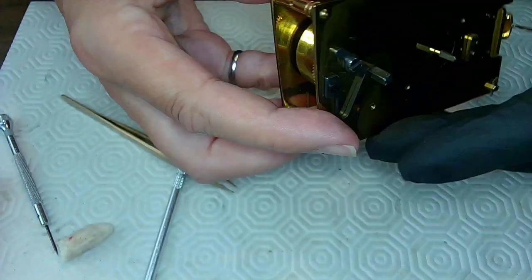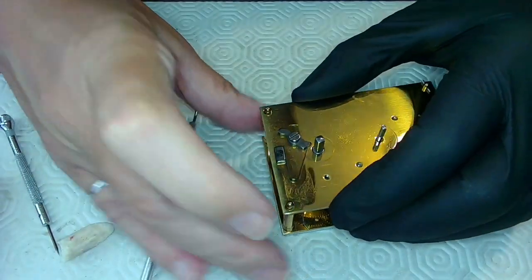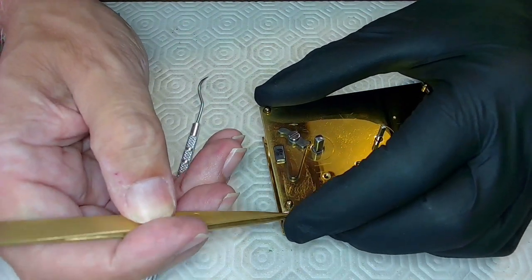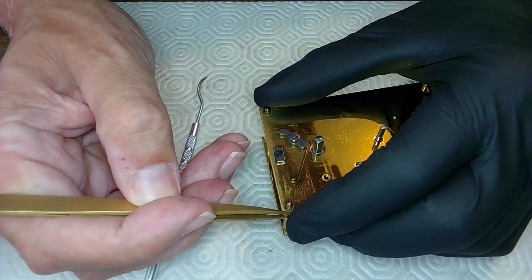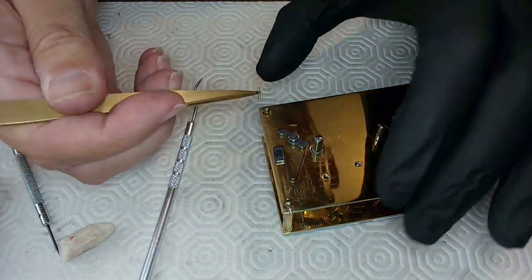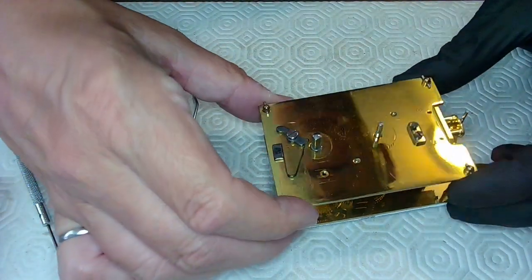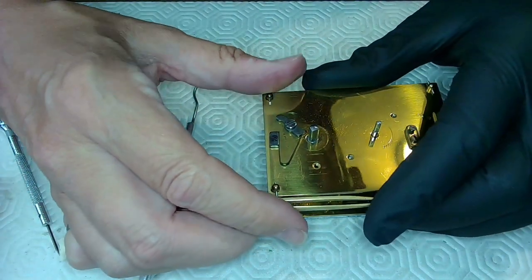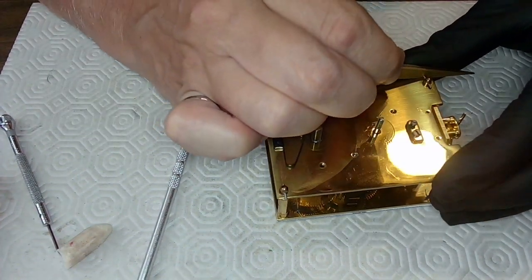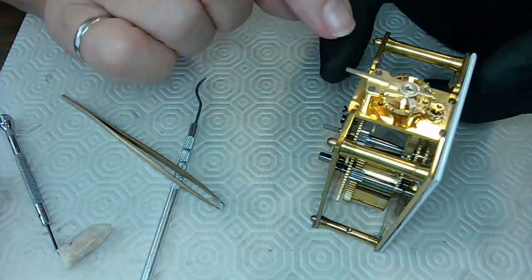It was out here, but now it's in. When I put these pins in, I'm putting them so the thinner part of the pivot is pushing inward. Another one in there — I eyeball them to see which part is thicker so I know the orientation. That's that right there. I'm just going to push these in a little with the back of my tweezers to get them in a bit, like that and like that.